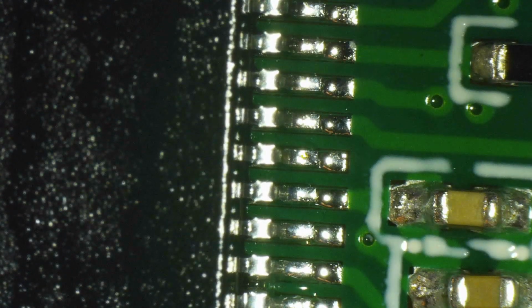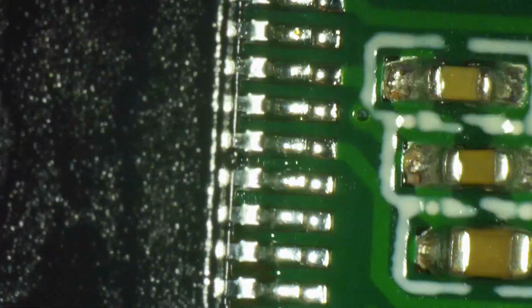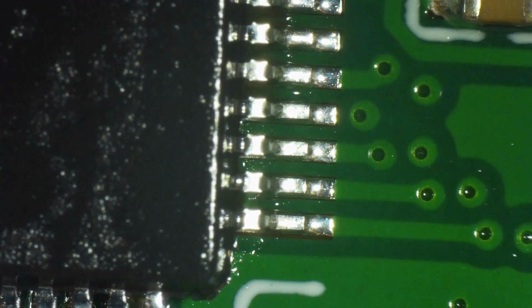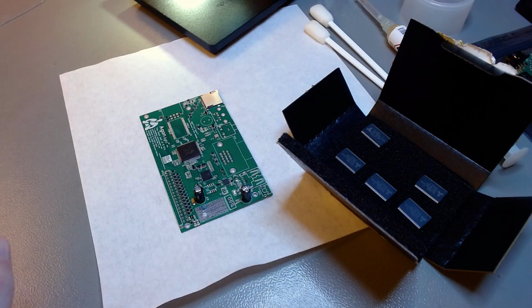The fact that I had to do that, to remove the solder paste, was a little extra risk, but as you could see before, even though the solder mask was missing, there was no bridge, there was no short circuit. And after the soldering, if there are no short circuits, then it doesn't matter whether the solder mask is there or not. It will have done its job already. It's no longer needed. Okay, the CPU is complete.